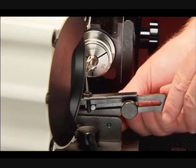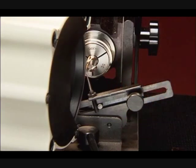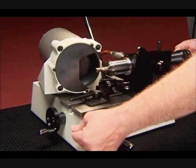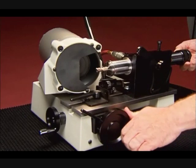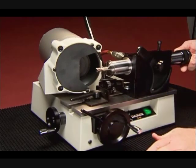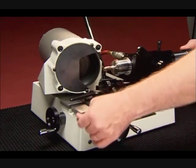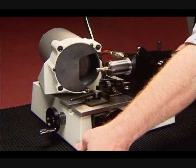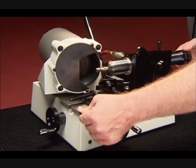Move the stylus into the secondary position by loosening the knob and rocking the fixture up and back as far as possible. Sharpen the secondary as you did the primary cutting edge. Thread the end mill onto the stylus as close to the shank as possible. Move the feed knob into the secondary until it touches. Then pull until the end mill comes off the stylus. Then push down the clearance handle, reposition, release the handle, and repeat until the secondary clearance angle on all flutes have been sharpened.